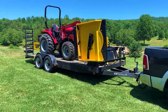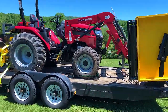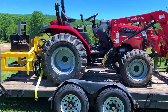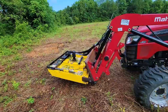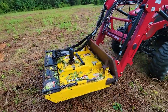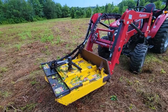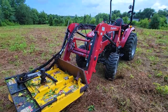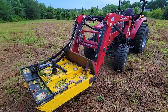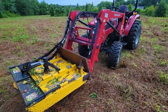This is what it originally looked like when it was brand new two years ago. As you can see, that is a lot of weight off to the side of the tractor. The TV Flex is normally offset way over to the side, and it says your tractor needs to be 3,000 pounds. Well this tractor is more like 4,000 pounds, but it was still too light and was constantly trying to flip over the tractor.